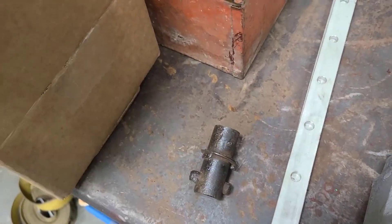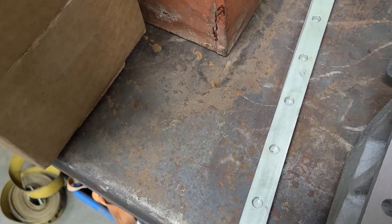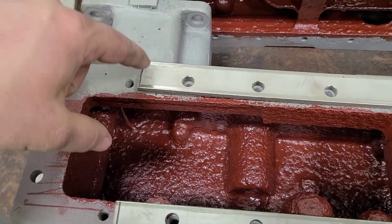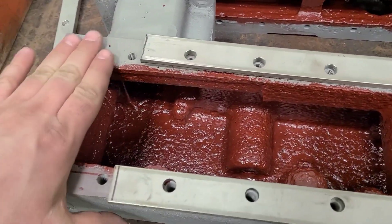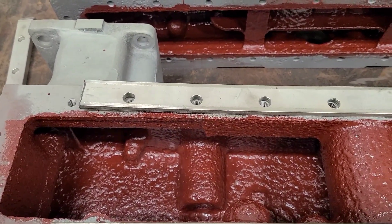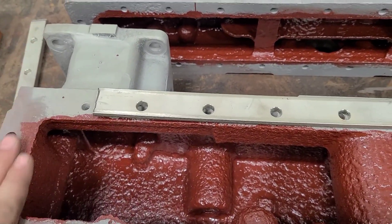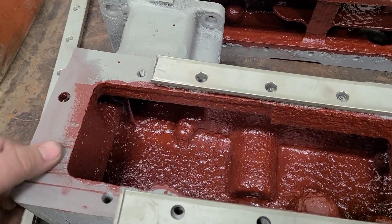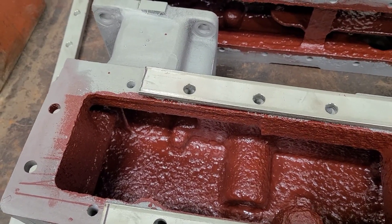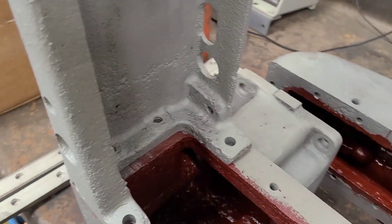In the meantime I'm going to box these up — I'm waiting on a reamer to press fit these pins in, so unfortunately that'll have to be in the next video. I want to get the sides on and get these trimmed down before I start milling these surfaces. Once all that is done, this needs to go and get a core put in it. I want these in place to dimension — it should not change at all when we take a little bit of material off of here. We're probably talking 25-30 thousandths at most.